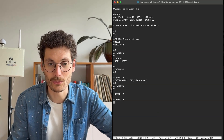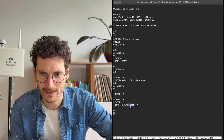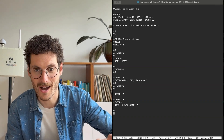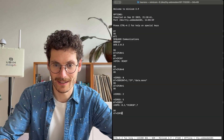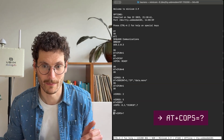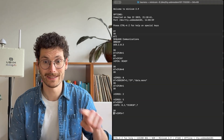We search for a network and find something interesting — the device is connected to a specific network number that you may already recognize from the Monogoto hub, because this number represents the private network we have set up. To validate that the device is actually seeing this network, I'm running the AT command AT+COPS=? which instructs the device to do a full network scan and respond with all networks in range. Beware, this might take a few minutes to complete.